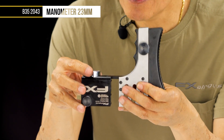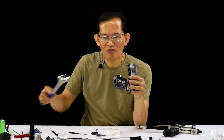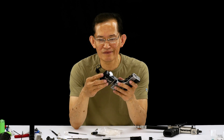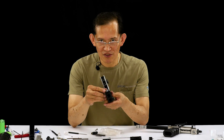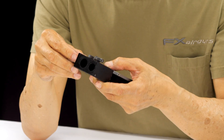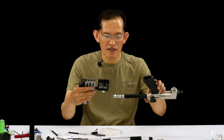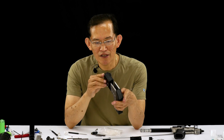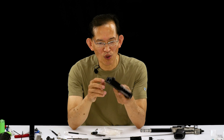A key point: with the gauge here, you only tighten it just enough to create a seal. Don't put a wrench on there and tighten the heck out of it. Guys who don't know their torque requirements will ruin this — the bore has a really light shoulder where the gauge sits. If you over-compress it, metal will stick out inside the bore, your valve housing cannot slide in, it will jam, and you'll have to replace the whole block. So don't over-tighten — just enough to create a seal.